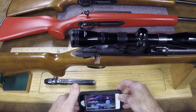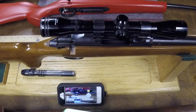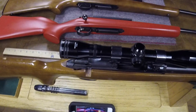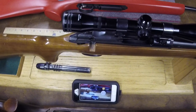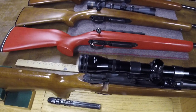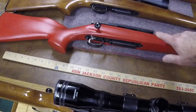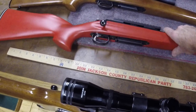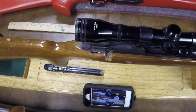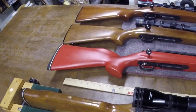I found conflicting information regarding timeline and I've looked at the Remington date codes on the barrels on these three rifles, trying to make some sense of which stock is on which rifle — assuming that other than the red rifle they are the original stocks. That may be a bad assumption; you have no way of knowing. The 308, which is the red rifle, I have no idea what the factory stock looked like — I never saw it wearing its factory stock. It's had this aftermarket custom stock on it since I got it, and I straightened it up, fixed it, re-bedded it, put this Evolution Gunworks base on it and shot it. By the date stamps on the barrel, that rifle says March 1977 for the manufacture date. There are also two families of trigger groups.